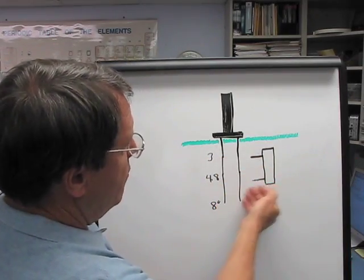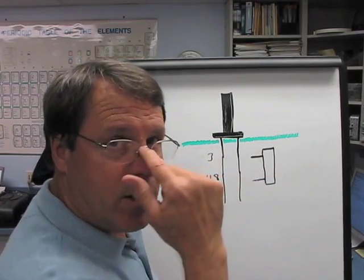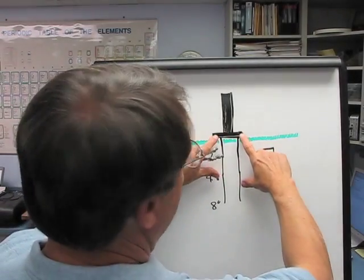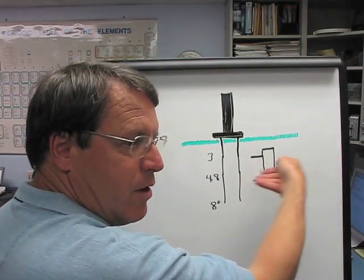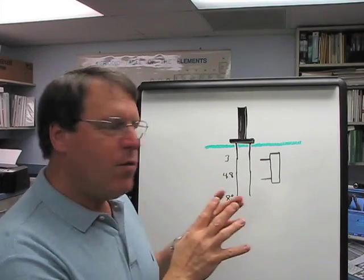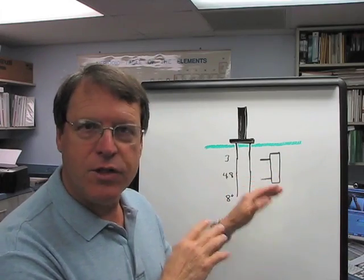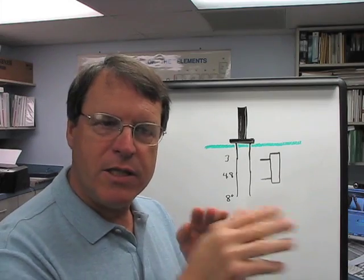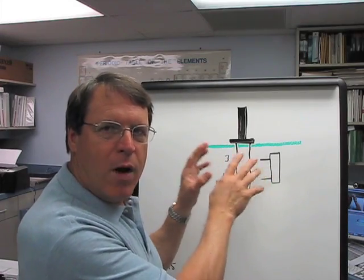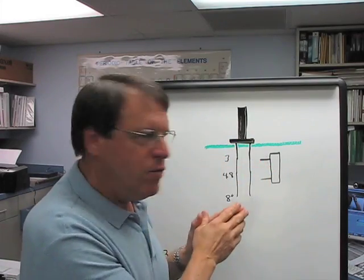Similarly at the 6.5-inch or 4.8-inch depth, we can't get a probe that perfectly matches — in one case you're averaging soil moisture over the whole probe length versus measuring horizontally at 6.5 inches. Both the Spectrum Technologies TDR-300 and the Turf Guard meters use time domain reflectometry for sensing soil moisture, so the sensing method isn't different — what differs is how they're positioned and how you use them.